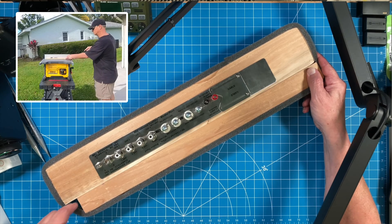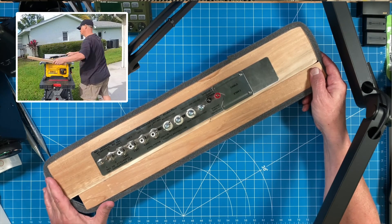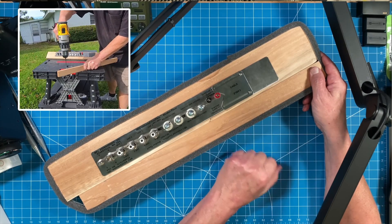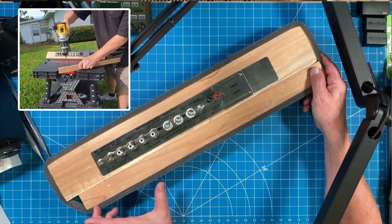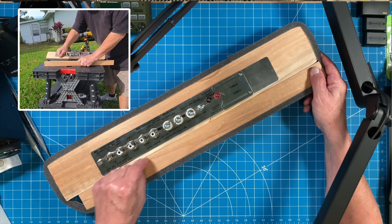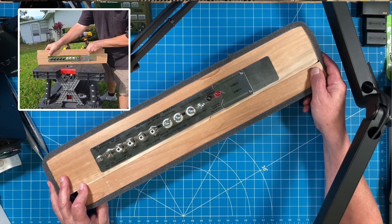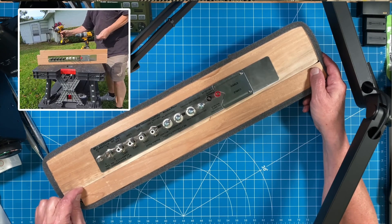My piece wasn't long enough, and that gap there is a problem — it's going to let air, weather, some rain, and heat in the summertime. So if you have to make your piece higher than four inches, you need to scab a piece on the bottom. You'll see me screw this in two places when I do the installation outside — I would do that about every eight inches or so. I would put a very high quality caulking in between, and I'd recommend silicone caulk exterior. GE makes a great silicone exterior caulk that lasts 10 or 15 years. Buy window and door exterior silicone caulk, put a bead in between, then screw it together.